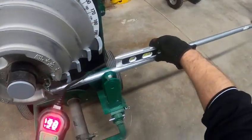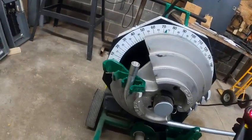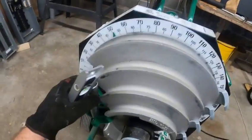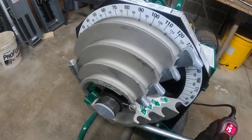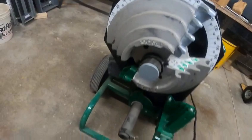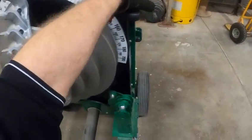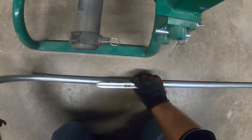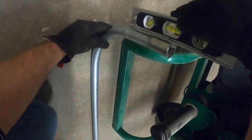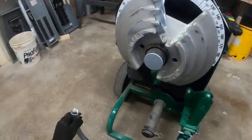We'll put our level on it — not quite level. We're going to unload it and see where we're at. We're able to get it out. It's always nice to return the bender to the loading position so the next person doesn't have to worry about it. We want to make sure we got a true 90. We can set it on the floor — we're level right there. And then we can check the coupling — pretty level right there. So we got a true 90. That's a good 90. That's how you use the Greenlee 555 to bend a 90 degree stub.